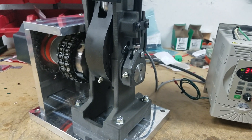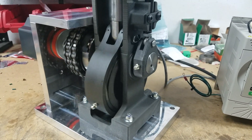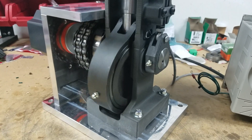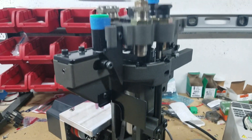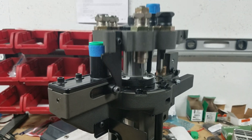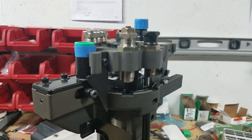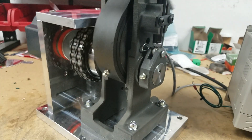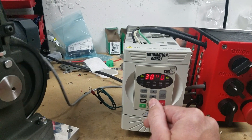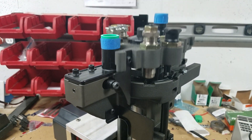Let's go ahead and turn it on. You've got the smoothness of the complete crankshaft 360-degree motion — there's no stopping and starting back and forth. It ensures you get a full stroke every time. There are no stepper motors to lose count, which they're prone to do. The faster you run a stepper motor, it can lose count. This is just a very smooth operation, and this particular drive will go up to 3,840 RPM just as smooth as can be.